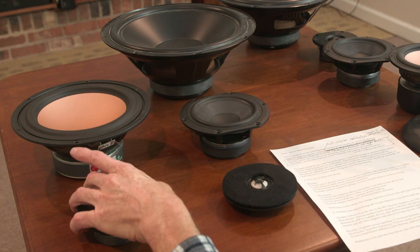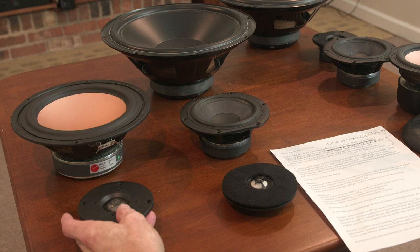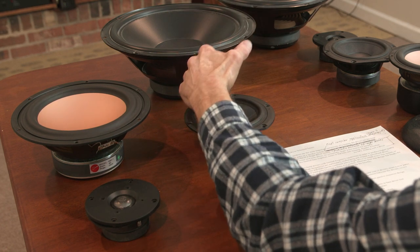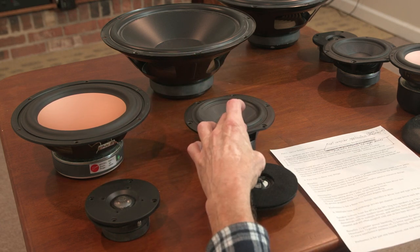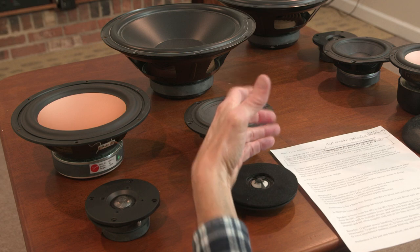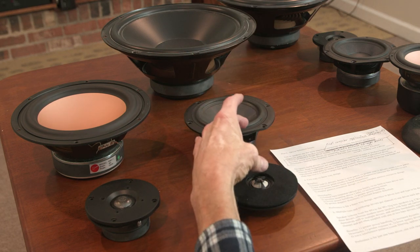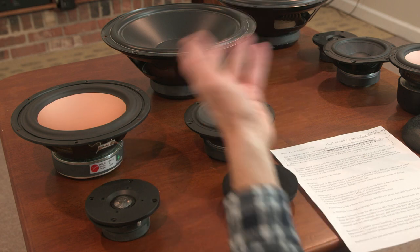And then a simpler passive design. When I was reading Speaker Builder magazine way back in the day, the DIY builders were suggesting to avoid a three-way passive design, do two-way passive only. In my three-way design that I built in those days, I had an electronic crossover between the bass and the satellite, and then a passive crossover between the mid and the tweeter for a satellite speaker. So it was a three-way system bi-amped, with one amp driving the bass speaker, these very bass speakers, in fact, from the 90s, and then one passive satellite speaker with a two-way passive crossover and one amplifier driving those. So that's an alternative I'll mention probably again later on.